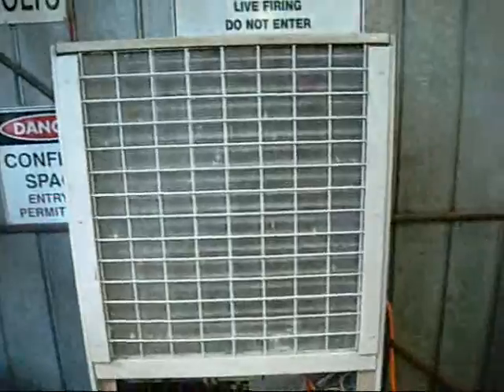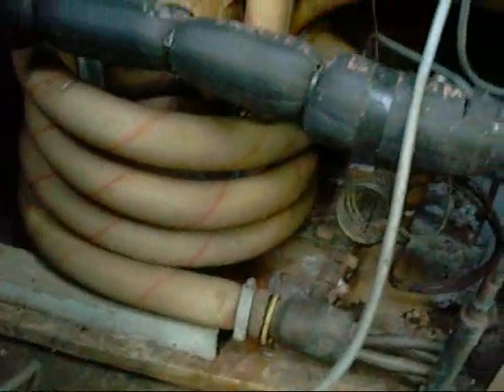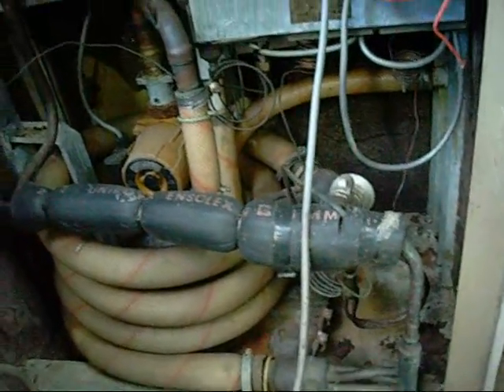Oh well, that's a good job for the cleaner. Get some condenser cleaner, scrape all that foam off, flush the system out and find any leaks — probably pressurize it to around 25 to 50 kPa at the most. Just a static pressure test to find any leaks; it's not designed to run under pressure.